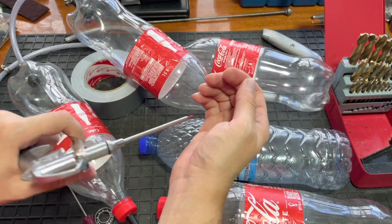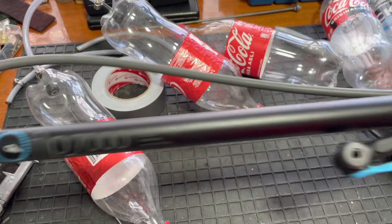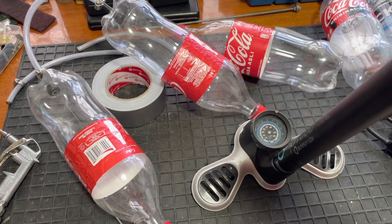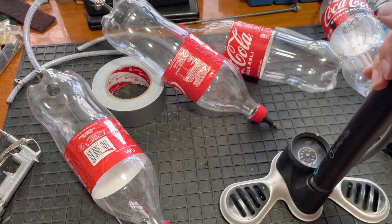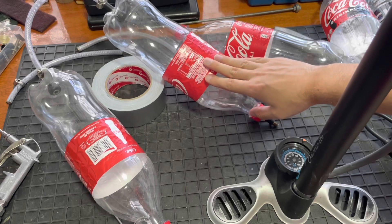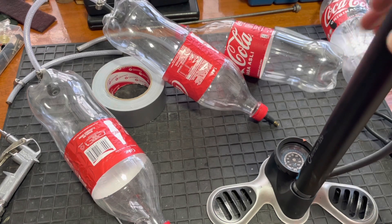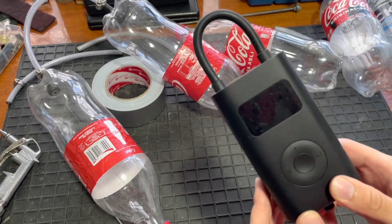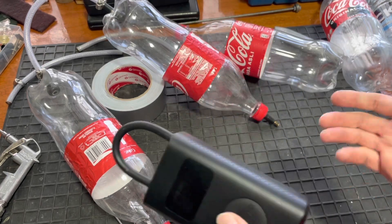How do you charge the system? One way is with a regular bicycle pump — you can pump this thing up to 100 PSI in exactly 70 pumps. I counted earlier when I charged the system. I generally don't pump to 100, only to around 91 or 92 for safety. I know these are good for 115 PSI but I don't want to test them to that limit. The way I actually prefer to charge my cylinders nowadays is with an electronic bicycle pump I bought off AliExpress — about 50 to 60 Brunei dollars.